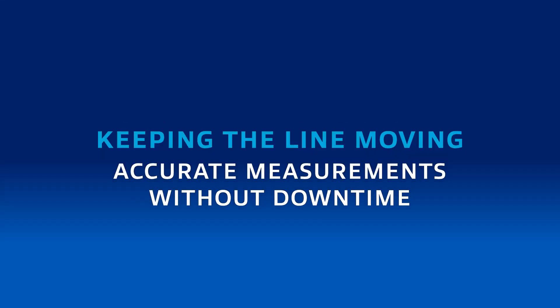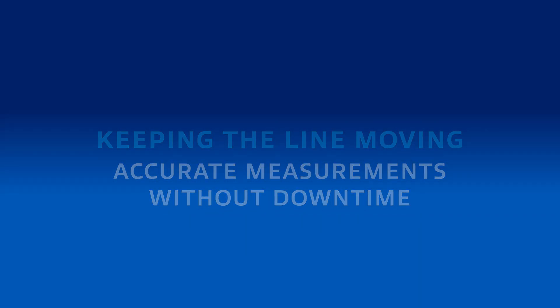When you talk about the inline sensor, why is inline so important? Inline is important because it really helps to improve efficiency. While it's inline, the part is being inspected as it's moving. It gives people the ability to make corrections on the fly versus offline or near-line inspection where people take parts off the assembly line. While they're inspecting, things are still being made, so there could be something wrong that they're just finding out — and while they're finding it out, bad parts are being made, leading to a lot of scrap and inefficiency.